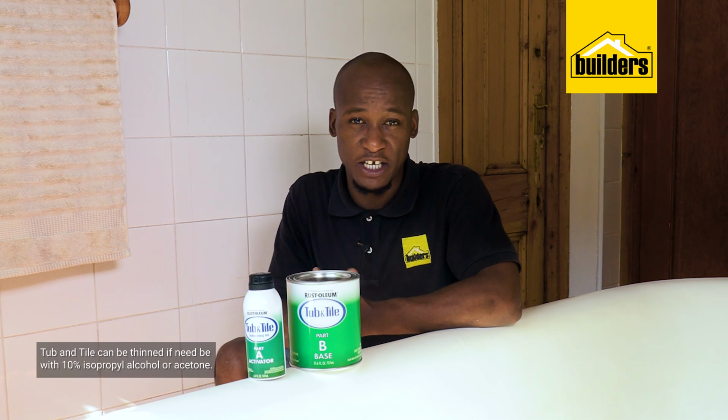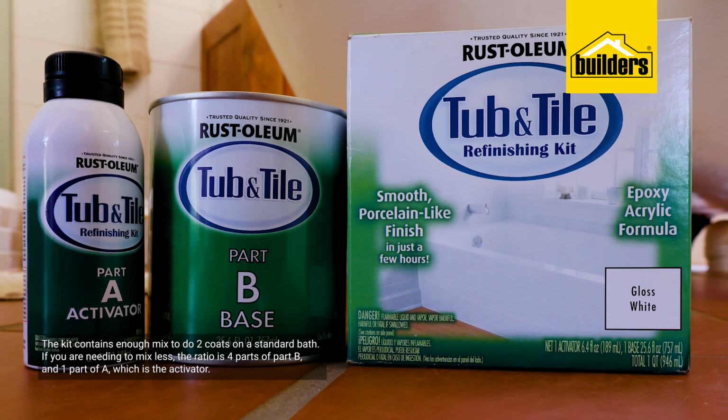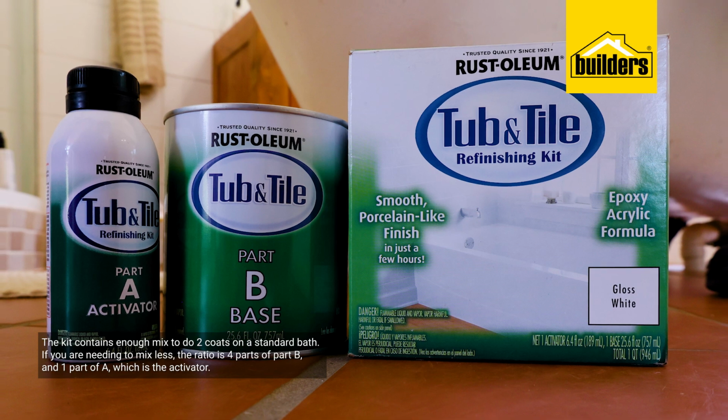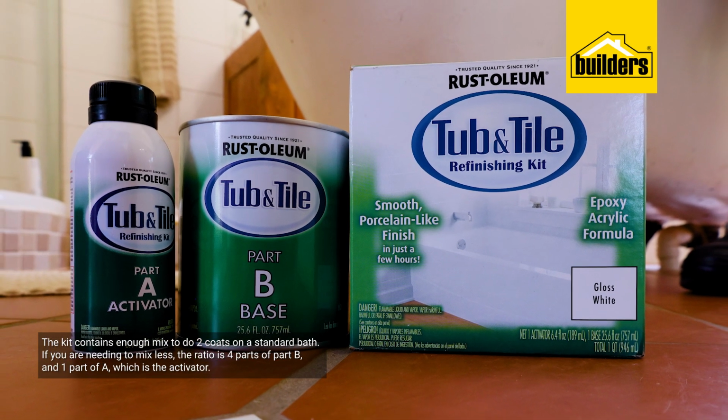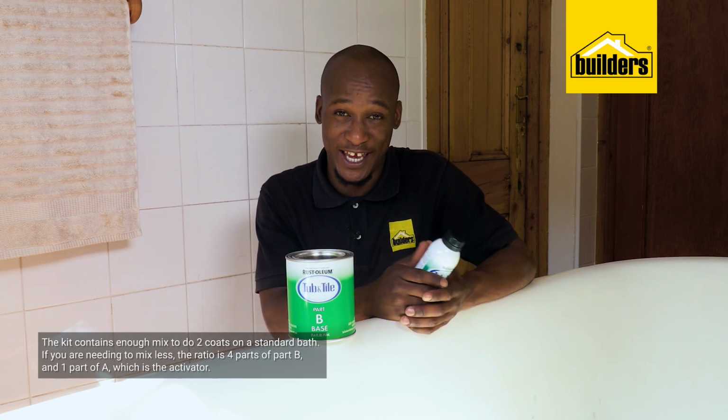Now in the event that you do need to thin it out a bit, let's say maybe you've got a crack that you weren't able to get rid of, to help it flow better into those cracks, you can thin it out with 10% isopropyl alcohol or acetone. The standard kit has enough to give you 2 coats on a standard bath. But if you're needing less, simply mix 4 parts of part B with 1 part of part A, which is the activator.